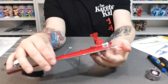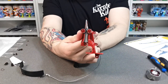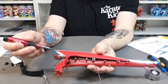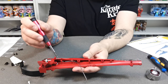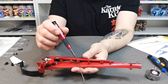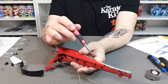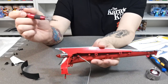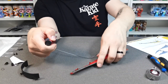Once it's all in place — it's fiddly but it looks nice when done. In the top here is a WP screw, and I recommend a little super glue behind there too. There's an NP screw here, an NP screw there, and down the bottom an LP screw. Get these right — if you put an NP screw in the LP position it will go through the other side and ruin it. NP, NP, and LP.